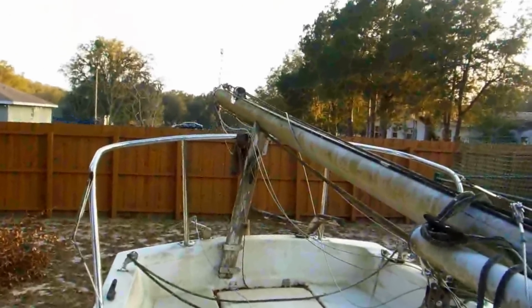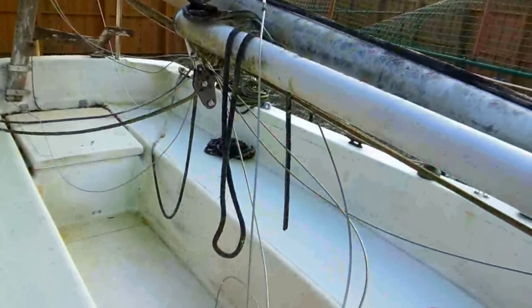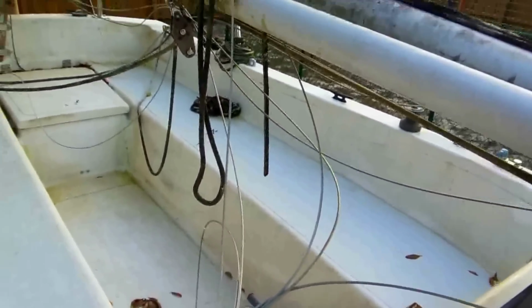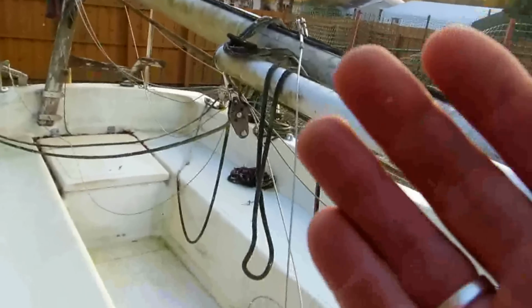If you notice, there's a CB radio in here, maritime radio, and if I put this antenna up, there's an antenna basically on the end down here, so if you want to really broadcast far away, this puppy will do it because it's an aerial antenna. That's the one damn good thing about sailboats, besides not using power except for the wind. You got some serious communication with this thing. See, I could actually hook up my little CB handheld. It will plug in to the antenna on the end, through the coaxial cable, and I can actually have an extremely long range antenna when I put it up through the top there. So that's one good thing.